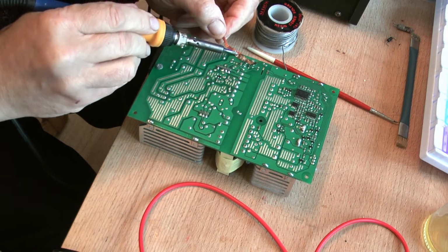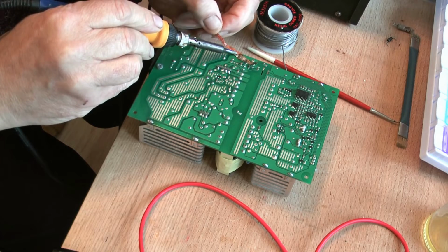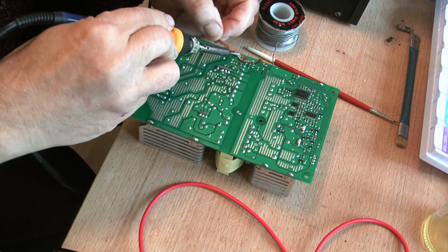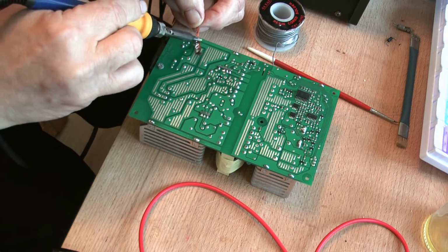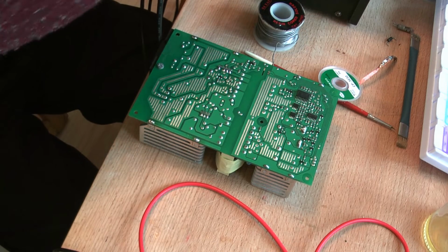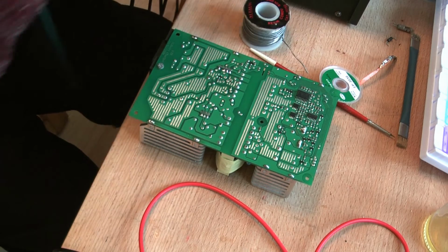Yeah, better check that one out. It's difficult, isn't it? And this is because these little lugs are a funny shape. They're an oblong shape, and it makes getting the solder away difficult. Let's see that now. Okay. Now, I've got to settle for that. I'm going to add a little bit more solder again, which seems a little... No, I won't. No, perhaps I will, perhaps I won't.